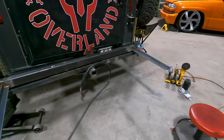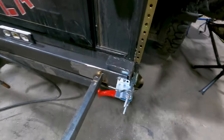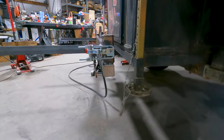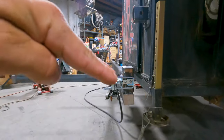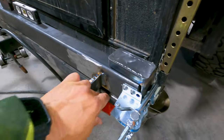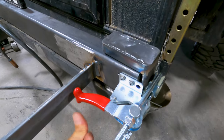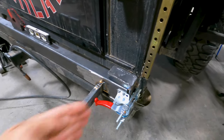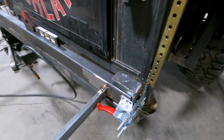Here we go. Okay, you can see it. I got the lateral arms out now. So those are 24 inches is what they're measuring. 24 inches on a 45. And so you saw what I did right here. Gave a little bit of gap for that. And then again, you want to make sure that when you line this up, your pull is horizontal. You don't want it to be pulling at an upward or down angle. It allows it to snap in real good. And I'll let you guys give a listen. So if it doesn't make this kind of snap, then you know that you need to adjust the height. You hear that? So it pulls it in, and once you get past a certain part, the tension on this draws it in. So you know that it's not just gonna want to break free.